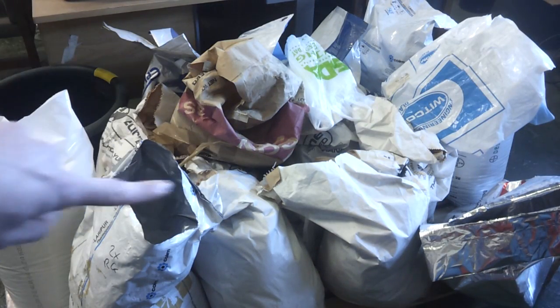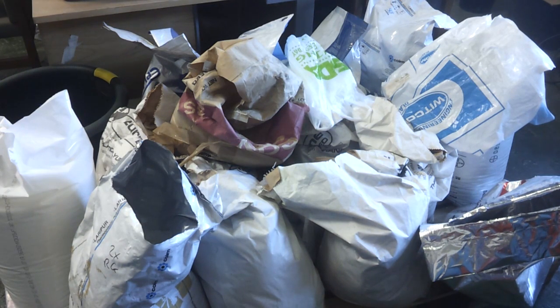The other key ingredient, of course, is the plastic itself. This is a real motley collection of different materials I've acquired over the years. A lot of this stuff — if you go talk to any injection moulding firm out there, they will have bags sitting in the corner that they are never going to get around to using, and very often they just chuck it in a skip. So if you can get friendly with a local injection moulding firm, you will have no problem acquiring plastic. A few kilos goes a long way for the sort of small-run stuff that I do. Generally it comes in 25 kilo sacks. You occasionally see this stuff on eBay as well. If you go buy it fresh from suppliers you could be paying several hundred pounds a bag, but if you know people who are using it, you can pick a bag up for typically around two pounds a kilogram — so it's not horribly expensive. You just need to know the right people and keep your eyes open.